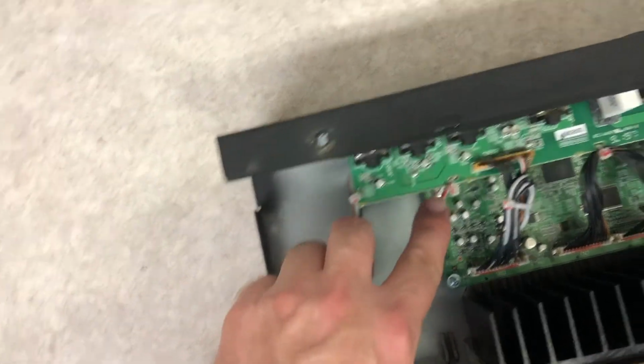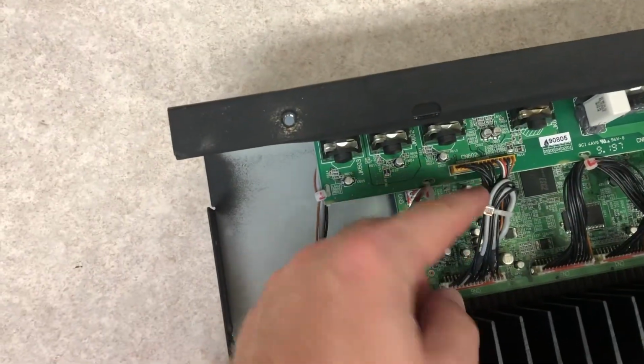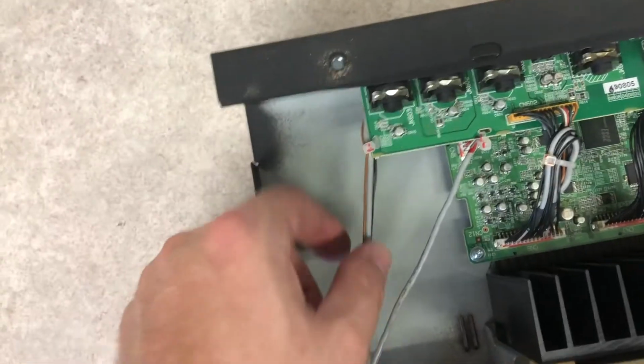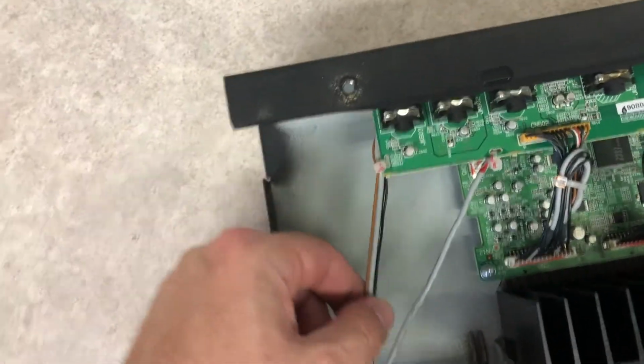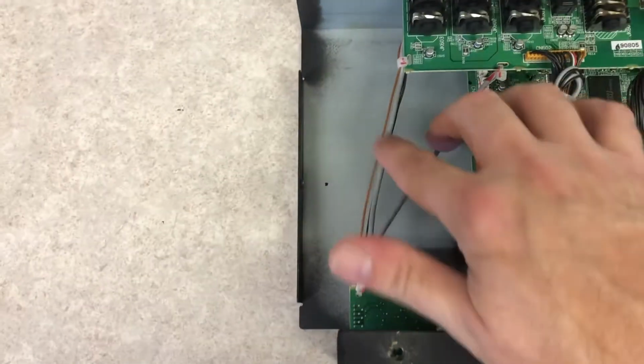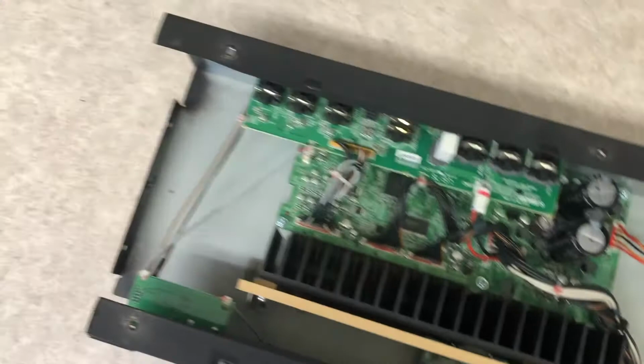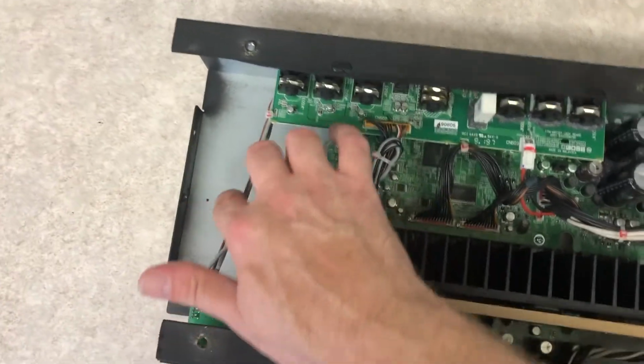Here's what I don't like. Here's the input jack. Here's the input jack preamp. And then this jumpers over and goes to a bridging ribbon cable. These bridge wires, they're tight. There's no give in them. There should be a little slack. So that seems to be a weak point, if this flexes at all or gets hot, something lands on that. I don't know what would land on it since it's on the inside of the amp. But come on, man, give us a little slack here.